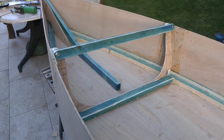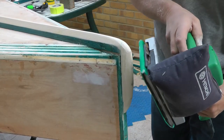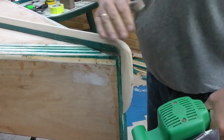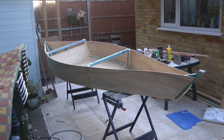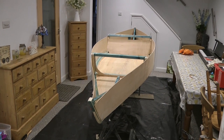A piece at the front also strengthens up the front end. Then a final bit of sanding — that's the back, with another sacrificial piece on it. You can see just a couple of cross pieces inside to strengthen the boat laterally. Now we're ready to do the epoxying.